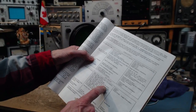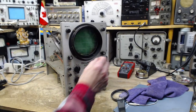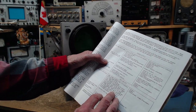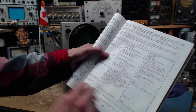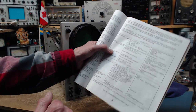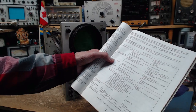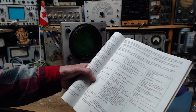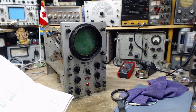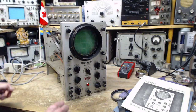High voltage rectifier tube V8 is defective, filament leads broken, no voltage on second anode — spot may be deflected off screen. Check vertical position for equal voltages from the CRT pins. The spot should have been centered. 'No spot on screen — defective CRT, defective tube.' Would you believe I have one of these screens? But goodness knows if it would happen to be exactly this one. 'Retrace blanking inoperative' — that's the deal: no high voltage. High voltage rectifier tube defective, filament leads broken.